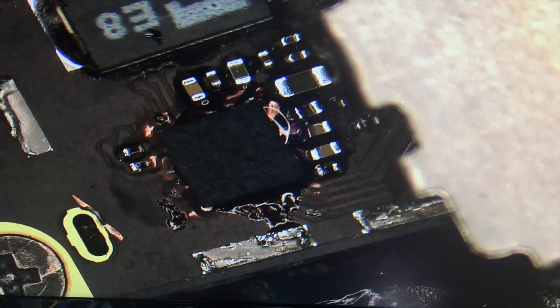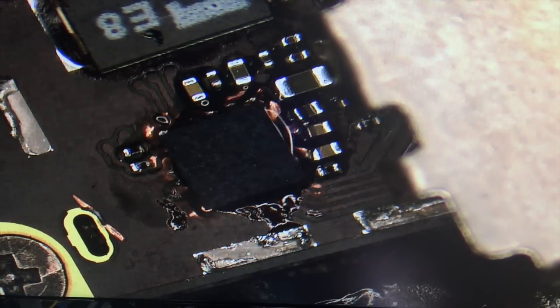Now, if this were leaded solder, I would be dropping my temperature down, and it would require a lot less heat. But since this is still lead-free, the lead-free solder itself is going to melt at about 260 C, and we want to give it a chance to do that. So we're going to watch to see the adjacent components turn shiny, and then we'll give it another few seconds after that. All right, so I'm going to go ahead in.